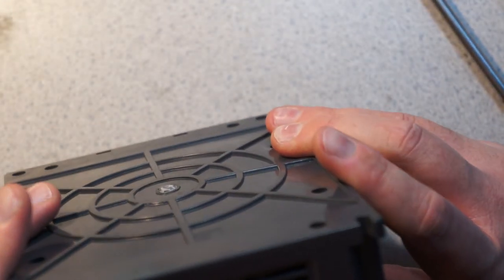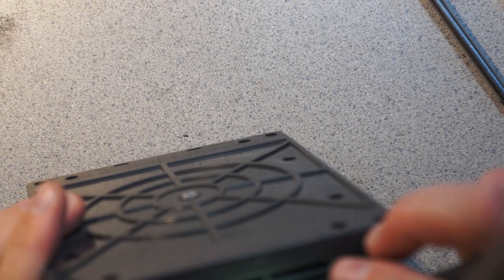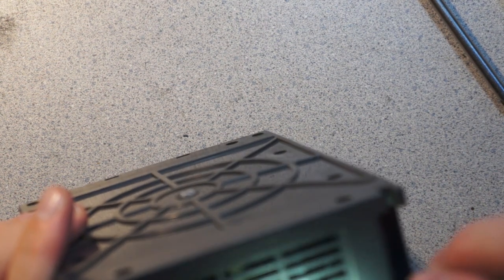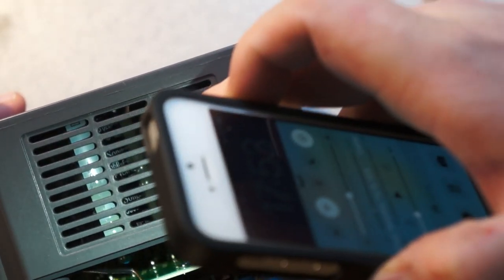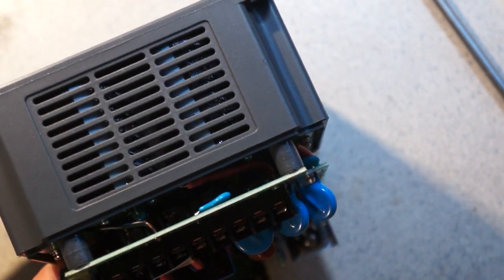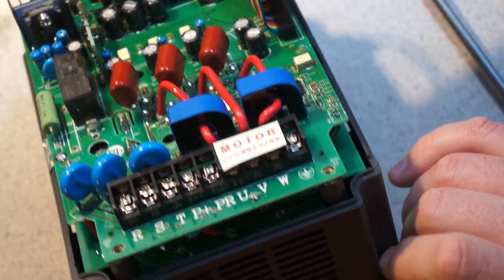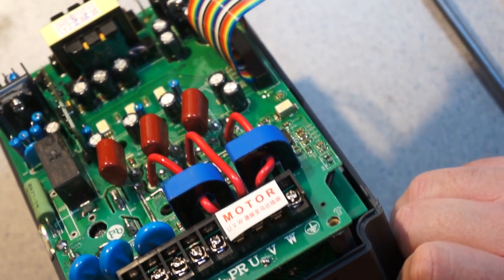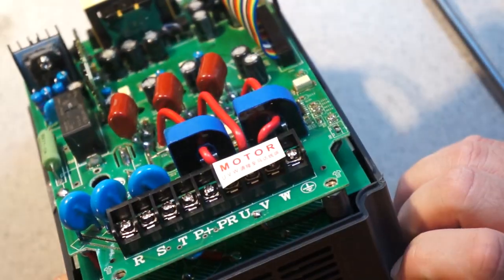Capacitors are SONGCON branded, 560 microfarads, 400 volt parts, and there's two of them, but they are at least 105 degrees C rated, which is nice. And then you can see there's a circuit board down there, which is like their mounting board. Another thing is that resistor there, from where it's placed, looks like it's probably a bleeder resistor. I can't decide if I think they're mounted in parallel or not. Each one has four pins, though I assume two are mechanical supports.